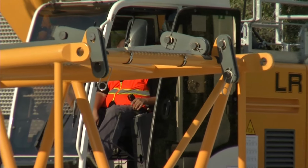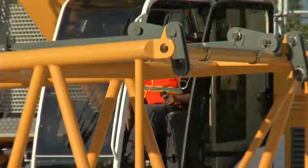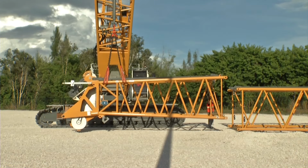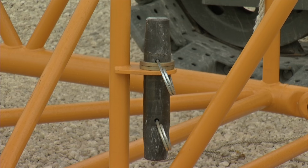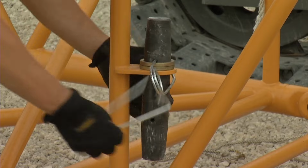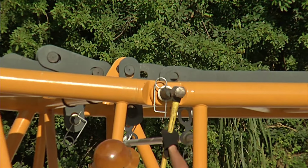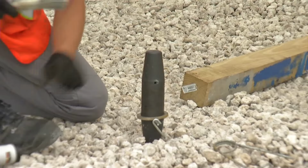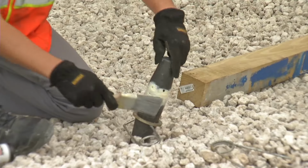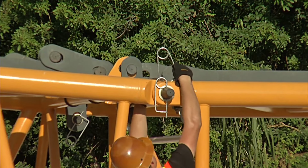Generally, the boom sections are always assembled in the same way. Here, this process is shown on the basis of boom head assembly. Position the boom head and pin the boom on the top boom connection lugs. The double tapered pins are delivered with the machine and stored on the boom sections. Ensure that the boom connection lugs are greased appropriately, and always secure the pins with the washers and spring cotter pins delivered with the machine.